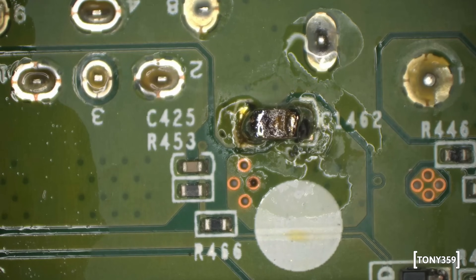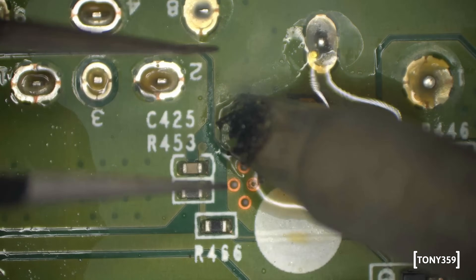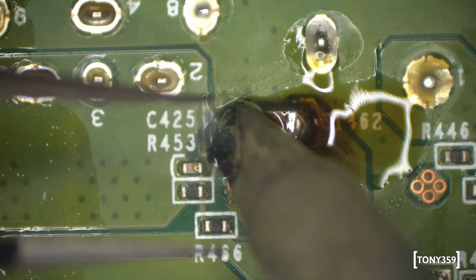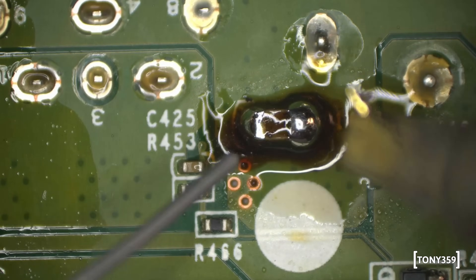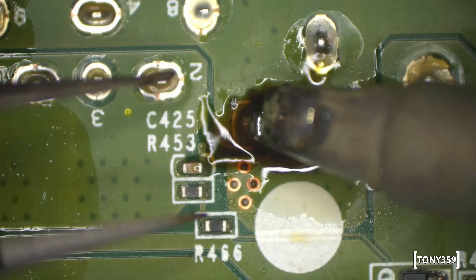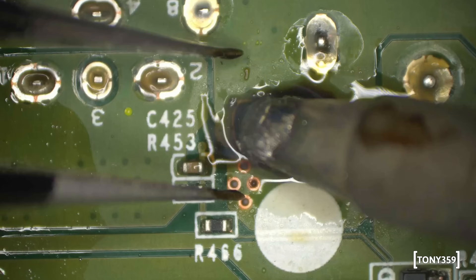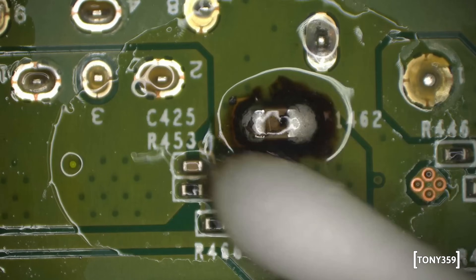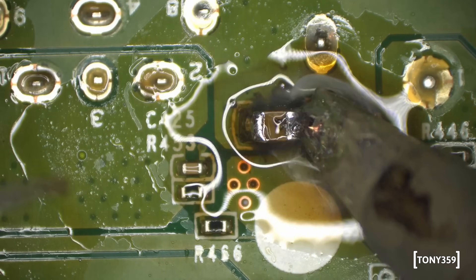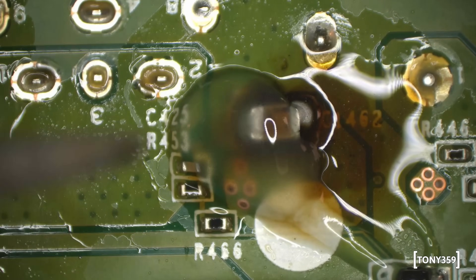This is probably my worst soldering shown on camera. I should have cleaned the tip. I went ahead with my usual method of adding a blob of solder without using hot air — it usually works totally fine without having to struggle with hot air. Well, it didn't work. This part of the PCB is full of ground and power planes, so the heat gets dissipated quickly — I wasn't expecting that. So after a while I added some low-melt solder, which should do the trick, except it didn't. Only after more struggling did I decide it was time to use another iron, and that worked like a charm.